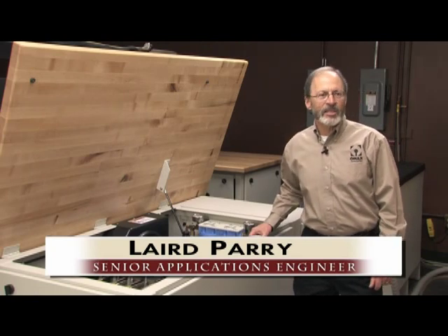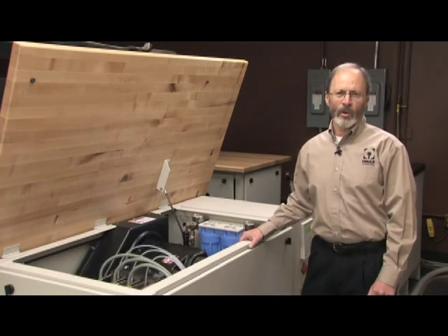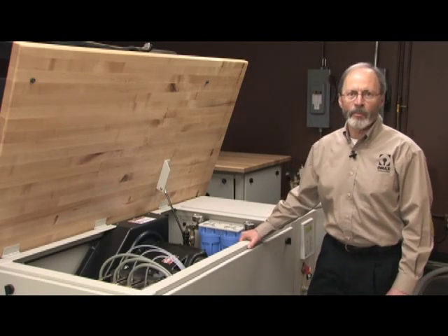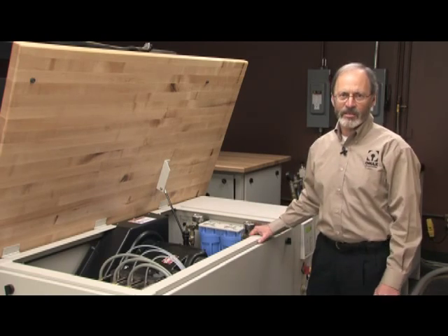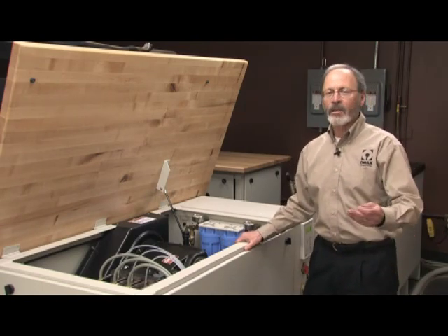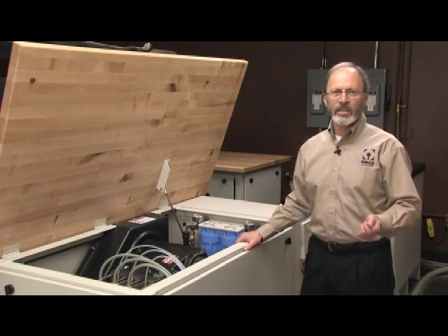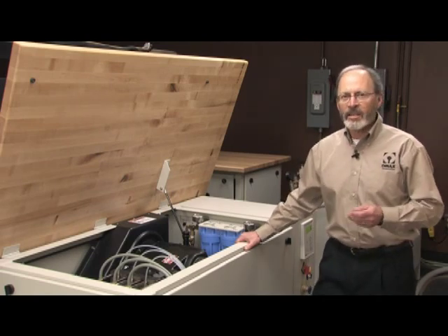Back in the late 1960s and early 70s, Dr. John Olson, one of the co-founders of OMAX, was one of the primary developers of the ultra-high pressure hydraulic intensifier pump. But you'll notice there are no intensifier pumps on OMAX systems. The reason is that in the 90s, Dr. Olson had a better idea. The problem he'd always had with the hydraulic intensifier is it's inefficient, it's noisy, and it's difficult to work on for people who aren't familiar with the way it operates.